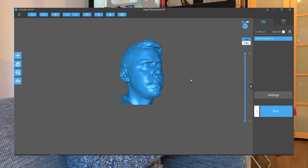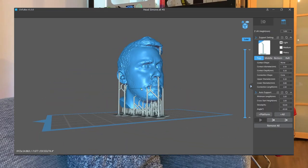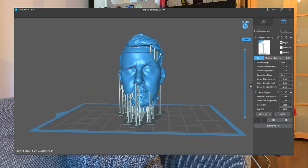I'm really satisfied with this machine. The price is great for a starting resin or MSLA machine — it's probably not perfect, but it's really fun to play with. Something I didn't mention: they have a slicer software called ChiTuBox. It works well — you can easily hollow parts, add or remove supports automatically, and then manually adjust them. Would I suggest purchasing this machine? For sure, if you want to start with SLA printing it's a great machine. My only concern is to make sure you do everything safely.